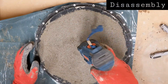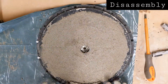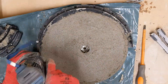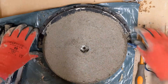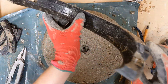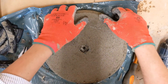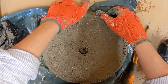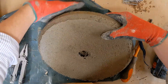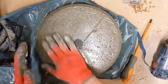At disassembly, I simply remove the screws one by one. I should have really put some masking tape on the screws — you'll see there are two that I have a bit of difficulty removing. It doesn't stop me removing the weight from the mold, but maybe think of that when you do this yourself. The chamfer allows a flathead screwdriver to simply pry apart the parts when they're a bit stuck, but otherwise it should just cleanly come away. There's nothing stuck to the mold. I'll now peel the plastic off the bag, and this should happen easily enough with or without mold release. I really do think the oil may be a bit of a cargo cult thing — I don't think it's absolutely necessary given the multi-part nature of the mold with the plastic.